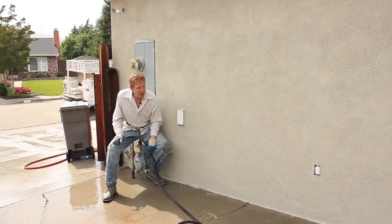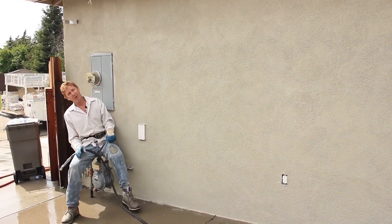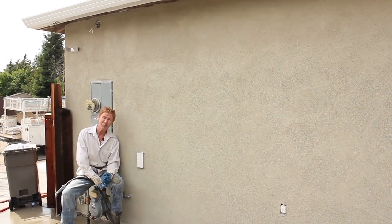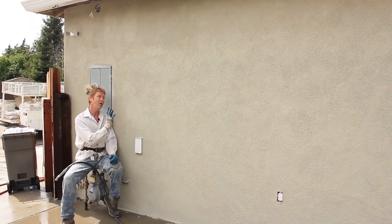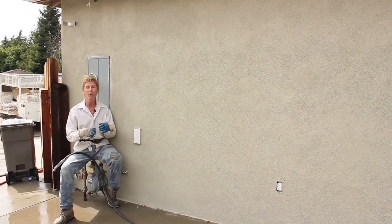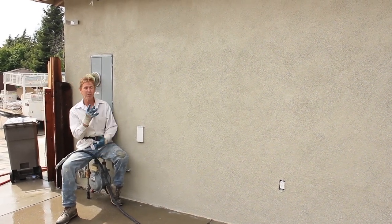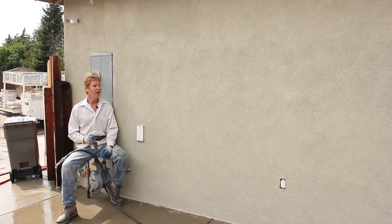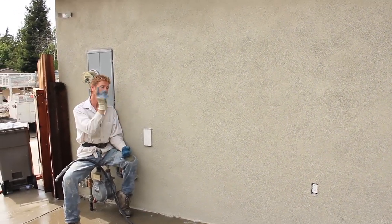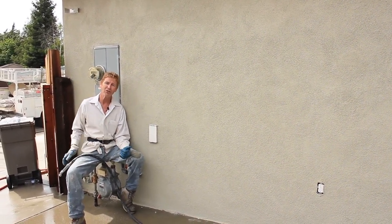We are complete. We're showing you this one wall, but we did quite a few walls. The moral of this video is: do not add the bonding agent to a cementitious material and expect it to bond to a wall. If you want a material that's flexible, buy an acrylic — they stick to everything and you won't even need to apply the bonding agent; they have a primer instead. We've gone from wall to wall, floor to ceiling, completely. The texture is solid, it's uniform, and that's the way it should be done.